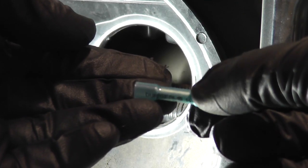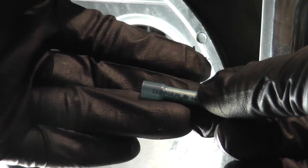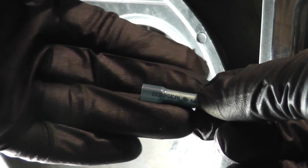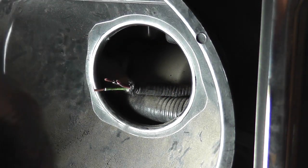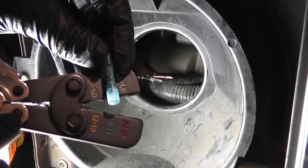These are the butt connectors I'm going to be using — heat shrink butt connectors. After I'm done crimping them, I'm going to heat them with a heat gun. The tubing will shrink, and there's a sealant inside that will make the connections weather tight. I have to crimp these connectors twice — once on this side and once on the connector side. Make sure you use the proper butt connector and the proper crimper die for the gauge wire you're crimping, as using a terminal or die too small or large will affect the quality of the crimp.